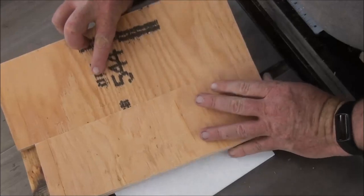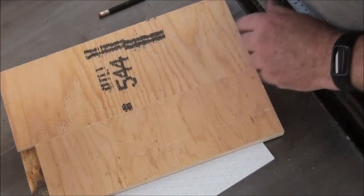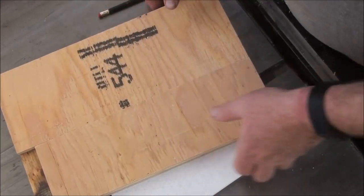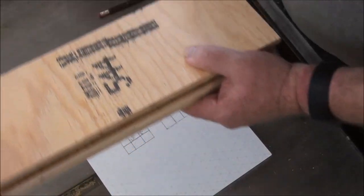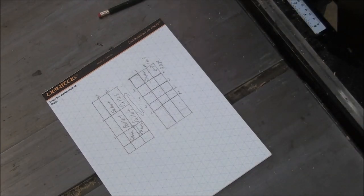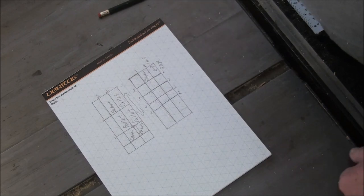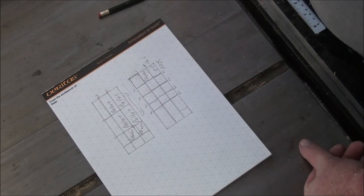When I make a bigger piece, they get too broad to clamp. So I'll just drive screws through that until the glue dries. The little screw holes, well, they're number 10 screws, they're not that small, but the screw holes don't bother anything. And they'll get covered when I wax dip the products and whatnot. So we're all good there.